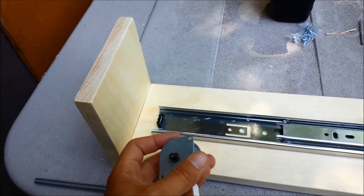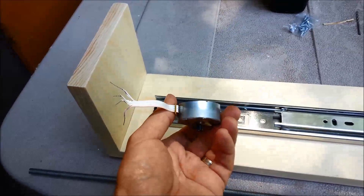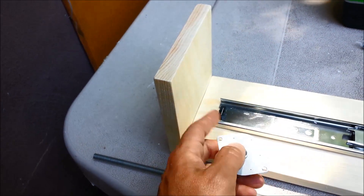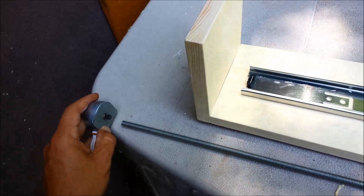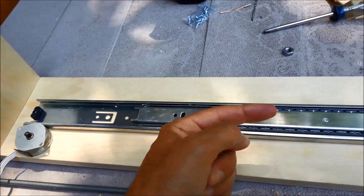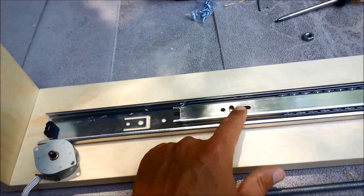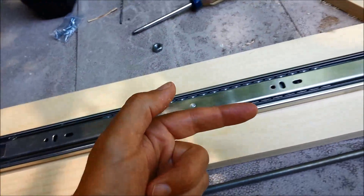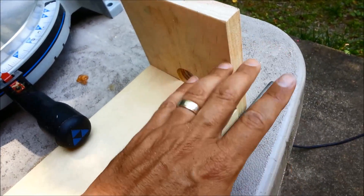The next part is to figure out the placement of the stepper motor. This is a little one that came out of one of those printers. It's going to be mounted on this side with a hole through here. The all-thread is going to be connected to the end with heat shrink tubing, go along here, be attached to a block. There's going to be a coupler built into that block; the all-thread goes down through here and sits through a hole to hold it up.